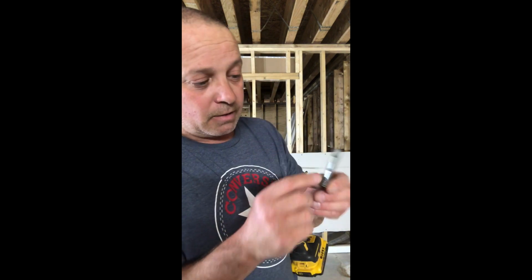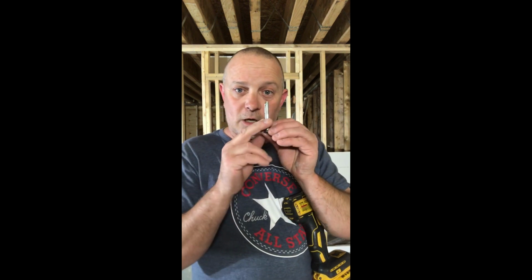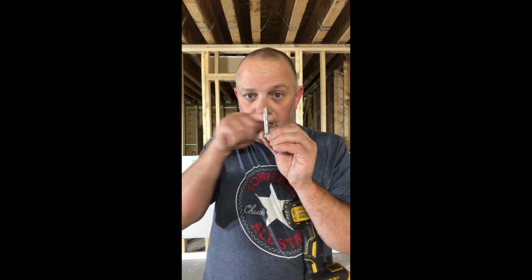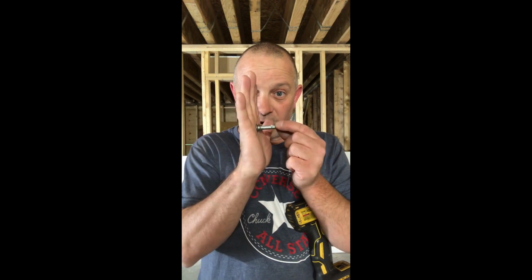And what happens is this thing screws in and there's a little, crap. There's a little bar in here. When you screw into it, it turns the bar and turns it sideways. So it sticks out the sides, kind of like this way, like a T. And then as you screw into it, it sucks this thing to the wall. It sucks it towards where you're screwing into, so going opposites. And now you have this T that's right up against the drywall flush. It can't come out.